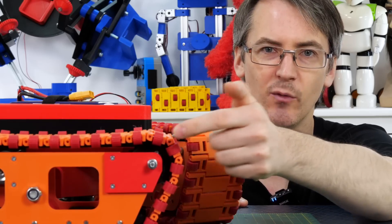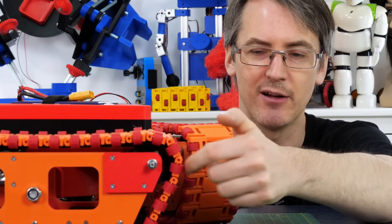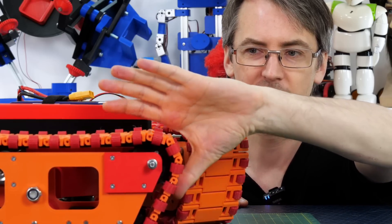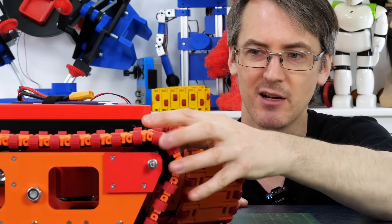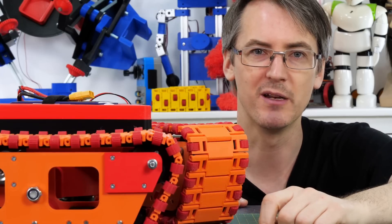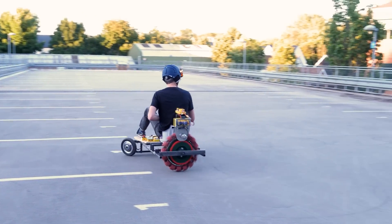We probably should have made these little wheels bigger, but if we make them too big they'll touch each other where the track bends around on the corners, so we'd have to make the sprockets bigger to avoid such a tight bend. Eventually to make the wheels bigger and bigger we'd end up with less and less radius on the sprockets — basically we'd just end up with a massive omni wheel, and I've already built a project like that anyway which you can check out on my channel.